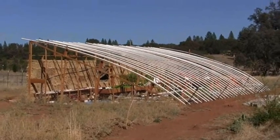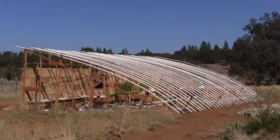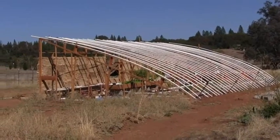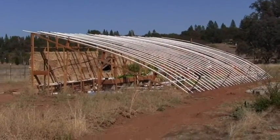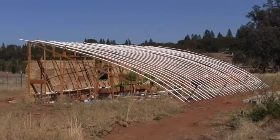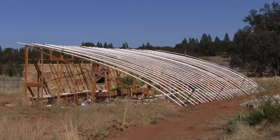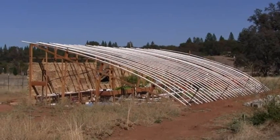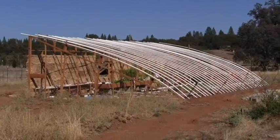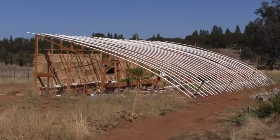This is the view from the southwest corner. Looking at the greenhouse from this angle, it's easier to see the shape of the greenhouse and the way the roof pitches down into the ground. The film will actually not go all the way to the ground — it'll stop short. In the wintertime it'll seal off to the ground. In the summertime, it'll create like a venturi opening at the bottom, with misters to cool and humidify the air coming in.